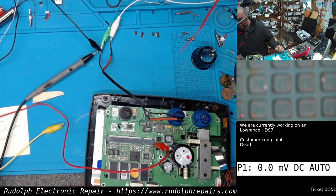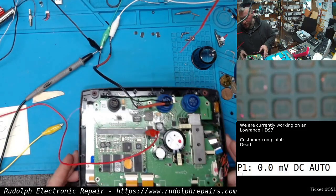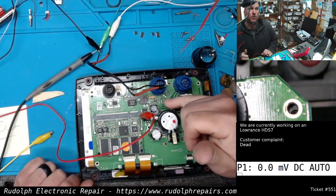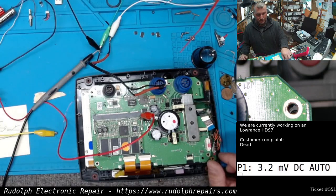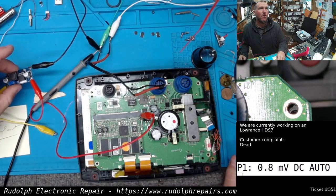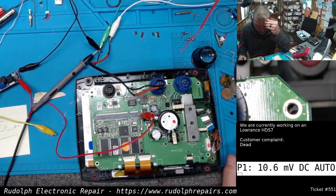Our donor board — it seems that one or both of those chips was bad. We don't have replacement parts for this thing, so what are we going to do? Got to fix it. What we did is we removed both those chips. This was completely dead — I was getting about 40 milliamps. We took our own buck converter, and what we're going to do is inject 5 volts into the 5-volt rail, doing away with all the stock 5-volt circuitry and introducing our own buck converter to power that 5-volt rail. But we can't just hook the 5-volt rail to the 12-volt supply because then it'll be on all the time.